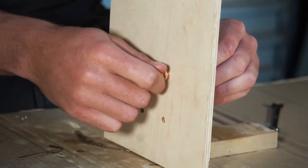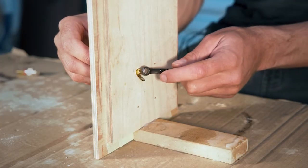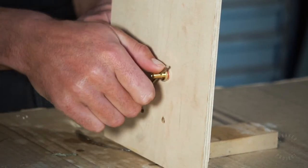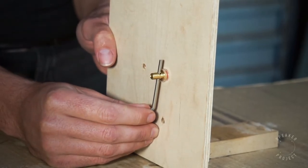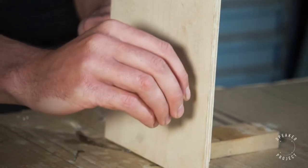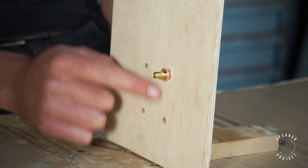Get your cable connector and put that on, then get your nut and place that on, winding it in finger tight. Then get your allen key and place it through the hole, and get your seven-millimetre spanner on the nut and wind it. I wouldn't go more than about three turns — two to one and a half is really enough. Also, I like to have my holes vertically aligned so it looks nice and allows speaker cable to go in cleanly.